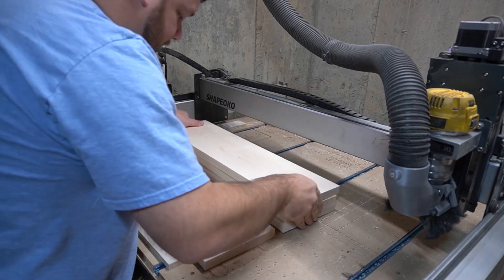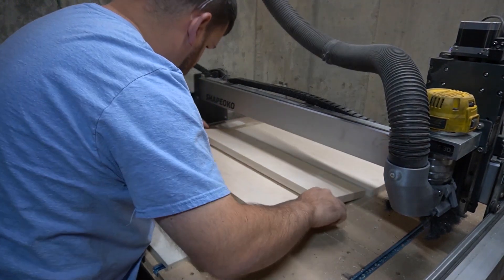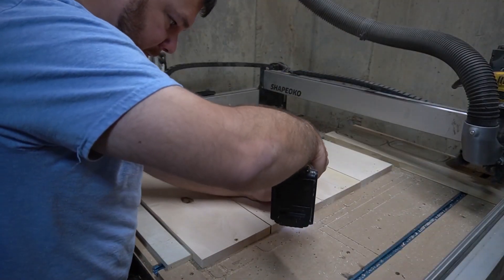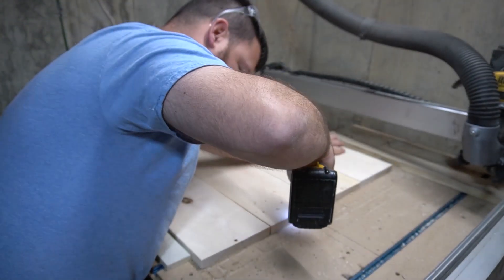I progressed to different things and eventually landed on, for a piece of wood where I was cutting out a lot of small pieces, actually screwing it to my workpiece right through the face of the wood. That way nothing is sticking above the surface for me to hit. Now for more delicate pieces where I need to save the face and don't have room to screw through, I'll use this double-sided tape. Don't just use any double-sided tape — this particular double-sided carpet tape works very well. I'll leave a link in the description below.